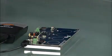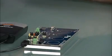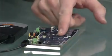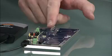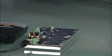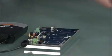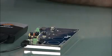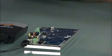In the first mode, for example, if you press B1, the ERM will spin, producing a click and ramp down waveform. If you press B3, you'll feel the same effect except with the LRA. When you change modes, the effects will change too. So when I change to mode 2 and press B1, the LRA buzzes using auto resonance tracking, and when I press B3, the ERM buzzes using closed loop.